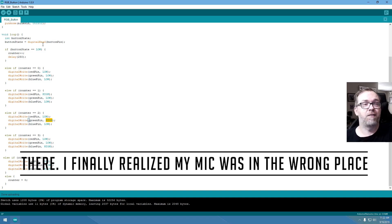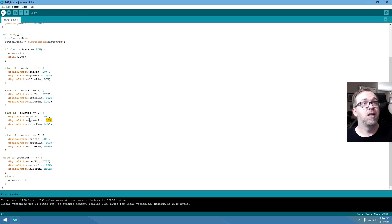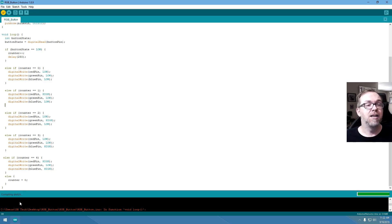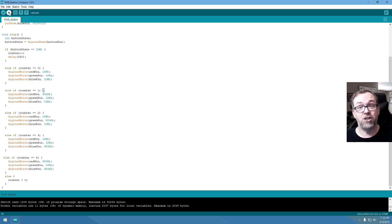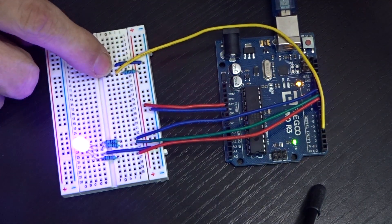At this point we go into the Arduino IDE options and make sure we've selected our board as Arduino Uno. Then we make sure our port is set - COM6 is the standard communication port for an Arduino Uno. Then I can click Verify to make sure the code looks good. If there's a problem - like a missing bracket - it'll throw an error and take me right to the issue. Once verify passes, I'll click the Upload arrow. You can see all the lights flicker for a second, and then if I press the button we get red, press again we get green, then blue, then purple, then off.